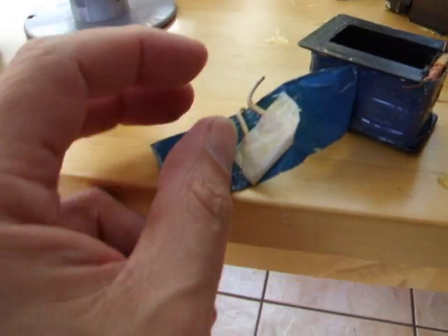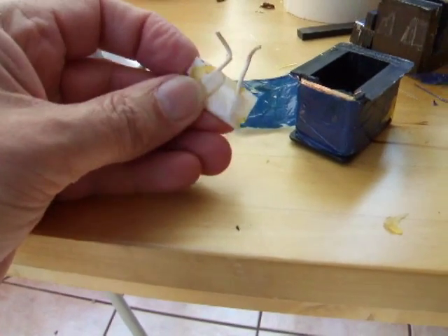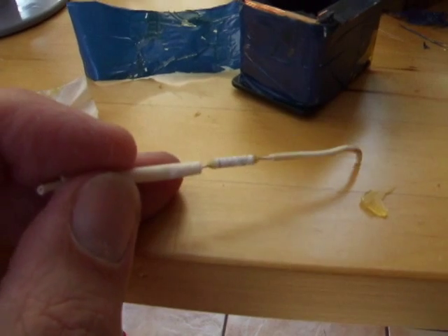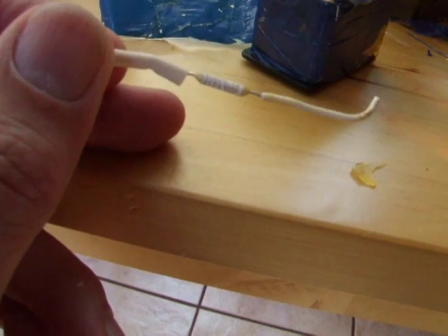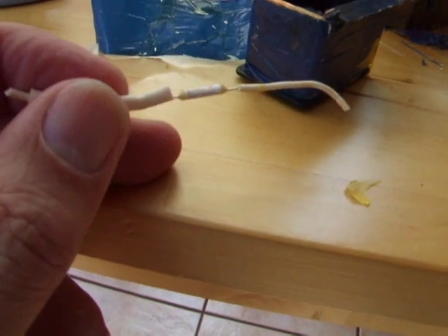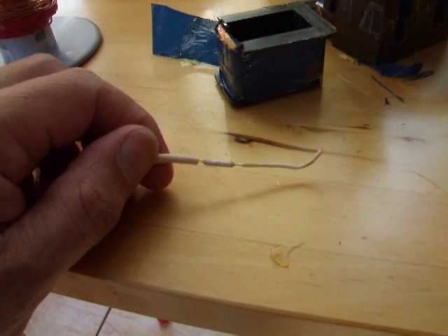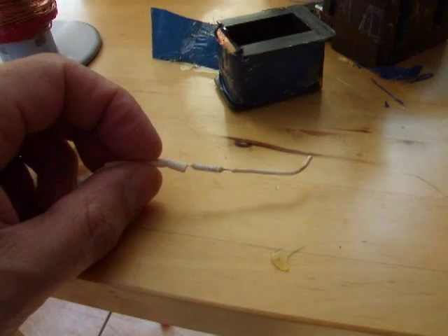Take that back — it's not two windings. As soon as I remove the bit of tape, you can see. That's probably a heat-sensitive fuse or something. There we are. Not quite sure what it's called, but I would guess that it trips if it overheats. Handy little find. Just reading what it says on it: UMI, 2 amp, 250 volt, 130 degrees C, Y2, 123 — whatever that might be. I assume it's a thermal cutout or something.